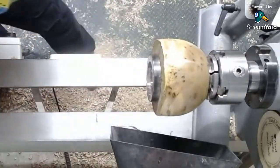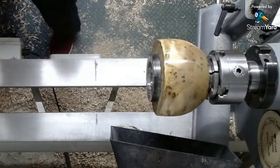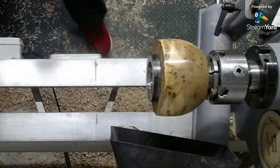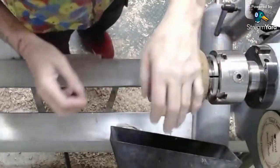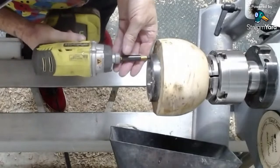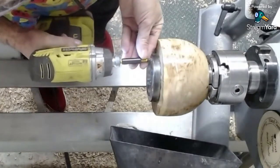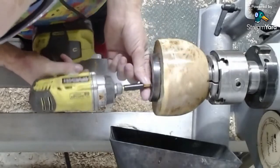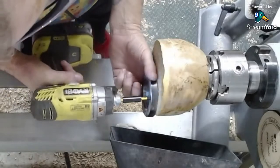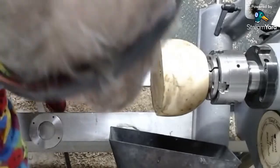Take that either way. And this was a little discussion we had yesterday: overtightening the chuck, particularly on a mortise, or overextending on a mortise, puts a lot of pressure on the wood, and sometimes that can be negative. It's getting it right. It's even like doing up a wheel nut too tight is worse than leaving it loose, because it will vibrate loose. Yeah, it's a knack.